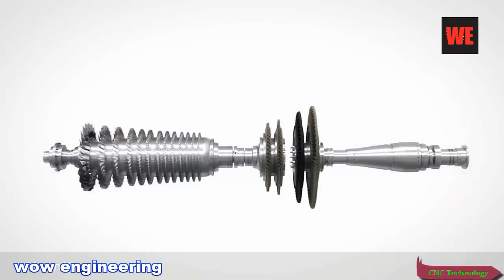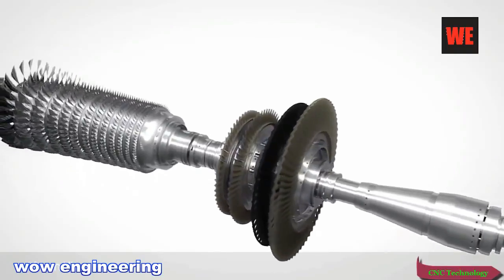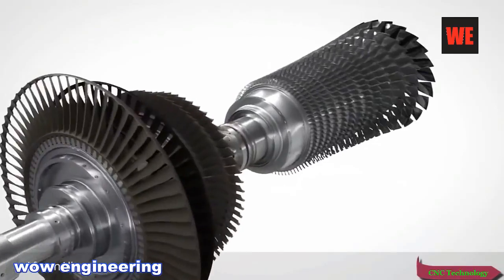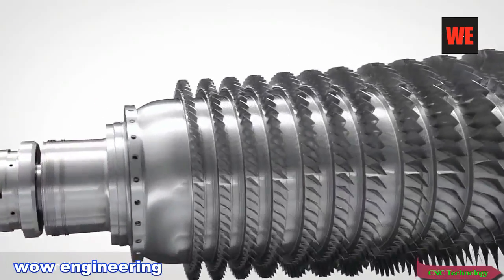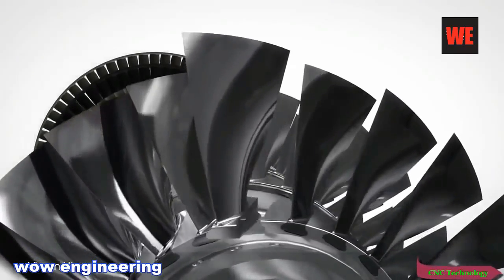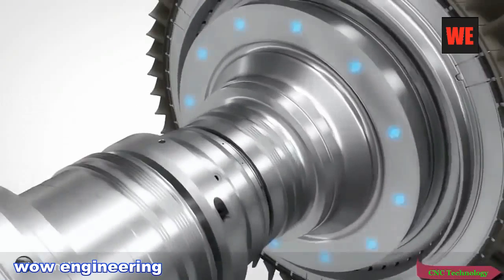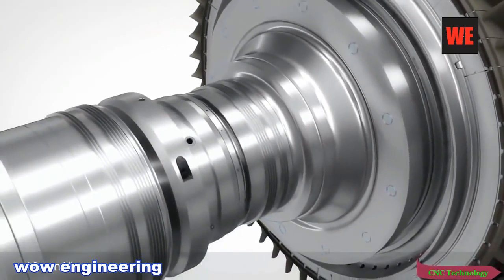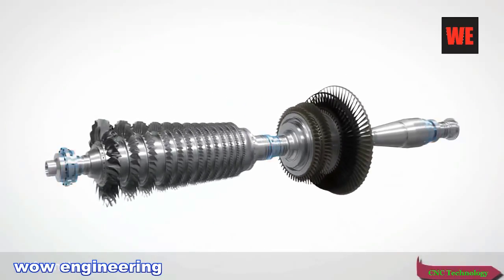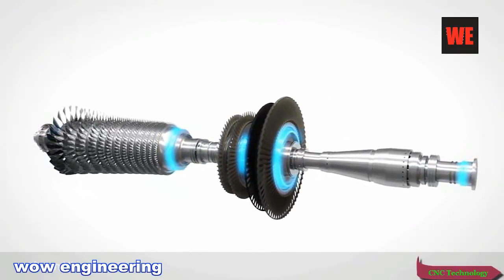The rotors incorporate the heritage of Siemens electron beam welding. The single rigid compressor rotor body ensures reliable, stable, and uniform run-up in hot or cold conditions. Axial blade attachment grooves allow blade replacement without rotor removal. The turbine discs are bolted to the compressor rotor and supported with mineral oil lubricated long life tilting pad bearings. The balancing planes allow field balancing on-site without disassembly.